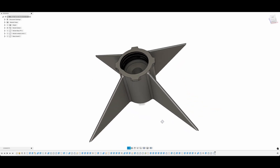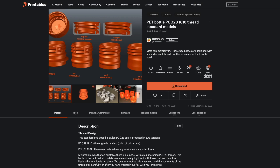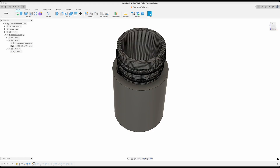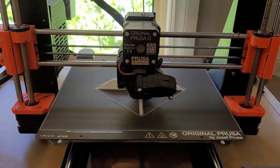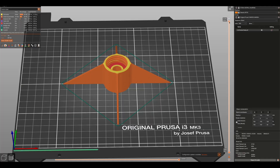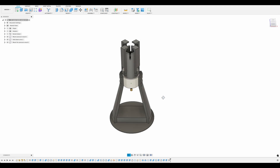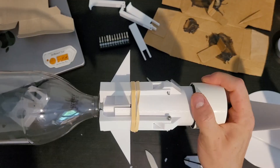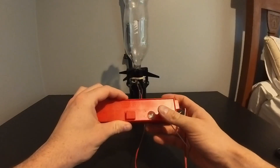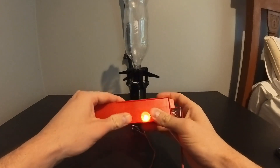The rocket itself is just some fins, a nozzle, and a screw thread to attach it to the bottle. Thanks to Stefanders who did the hard job of modelling the threads for the bottle — I just cut this out of the design I made. The rocket body and pressure vessel were printed from PETG with six exterior perimeter walls in the print settings. The launch mount is more complex: it contains a bike valve to attach an air compressor, a PVC end cap, a seal printed from TPU, and some hold-down arms which will be held against the rocket by a rubber band. To launch the rocket I'm using a model rocket igniter and a piece of metal wire from a scouring pad to cut the elastic band.